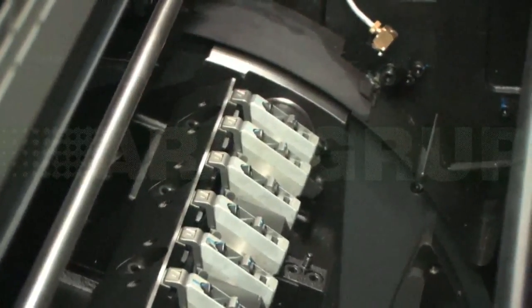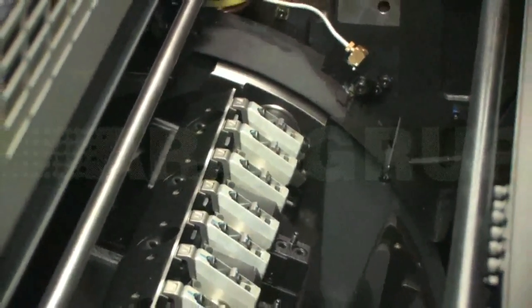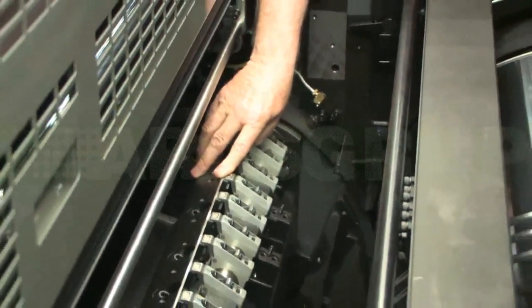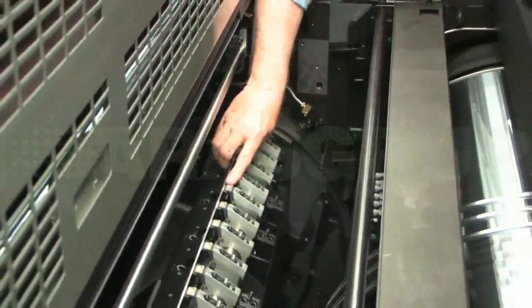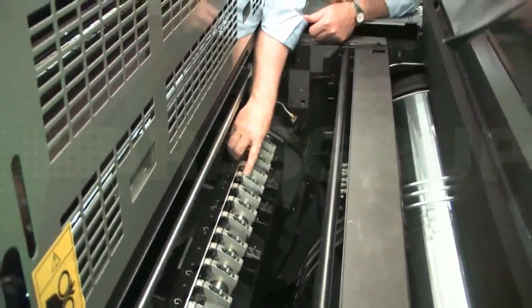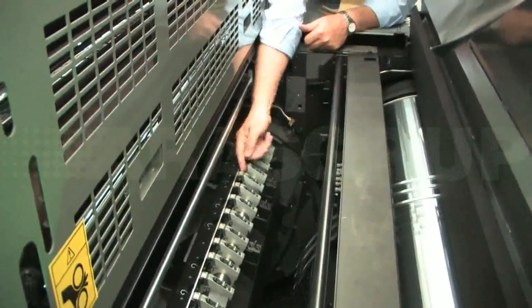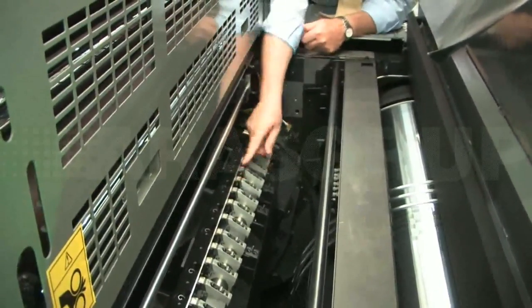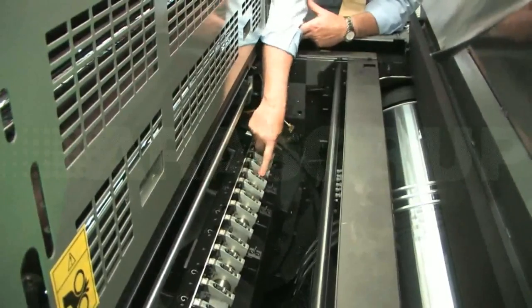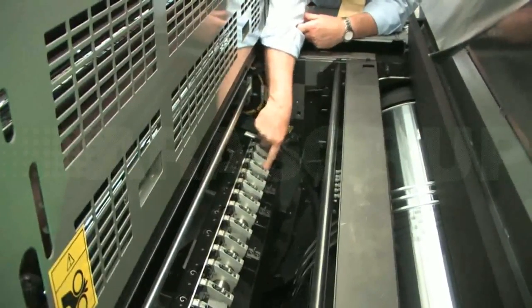So when we go to thicker paper we can change it, but in fact we don't need to change it up to 0.5. The gripper pads here are still the diamond pads. The gripper tip has got a special hardened face, and you'll notice that these here, these are the bearings which hold this shaft.